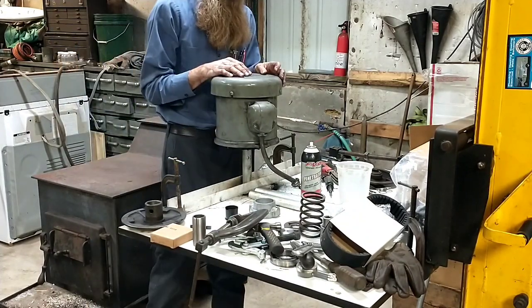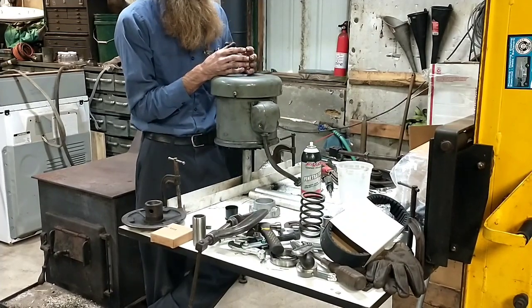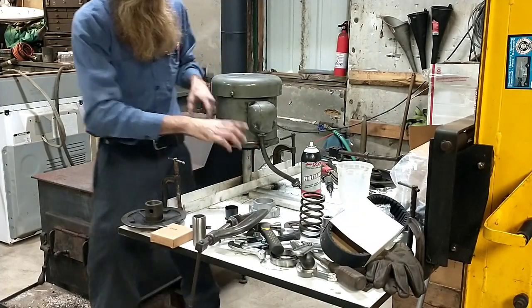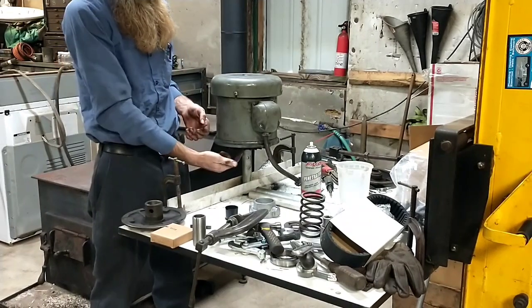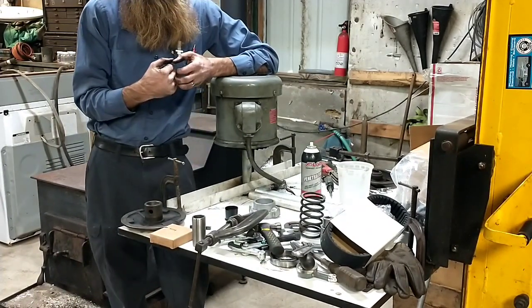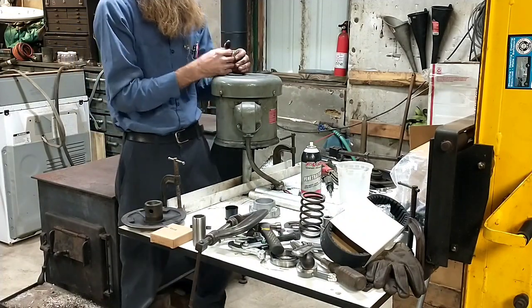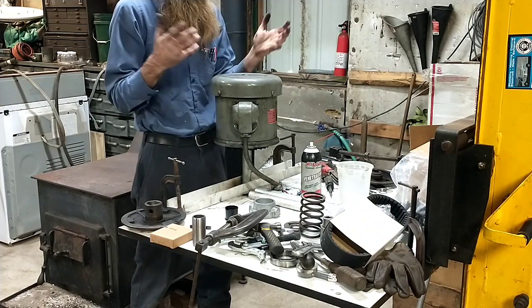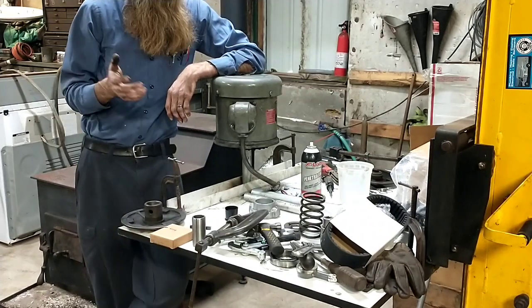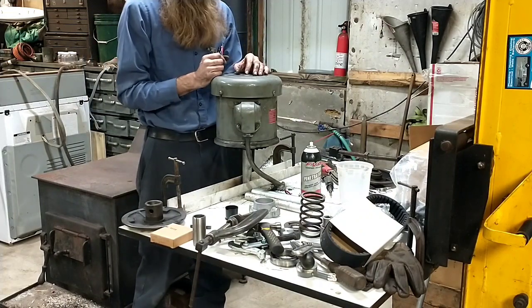Then the one thing that I would suggest, so you get that off, that's not a super heavy duty casting. So take that thing, prop it on these ears upside down between a couple of blocks, and just take a torch, even a propane torch, start heating up that aluminum, and within just a matter of minutes, it'll expand enough that the bearing will just drop right out of there with the armature. At that point, if we're replacing the armature, I don't even bother taking the bearings off it because both bearings have stayed with it.